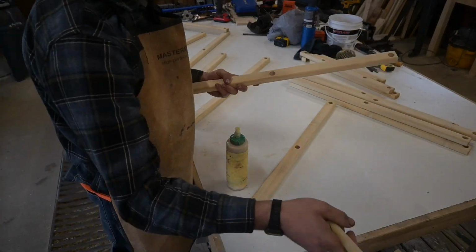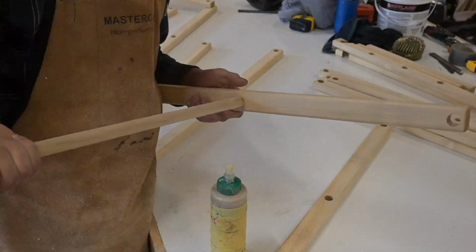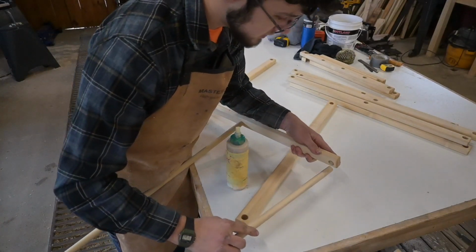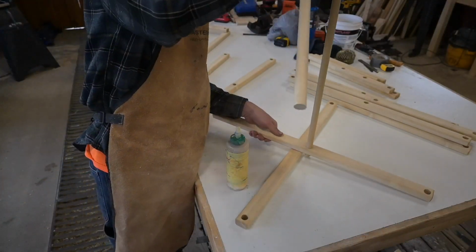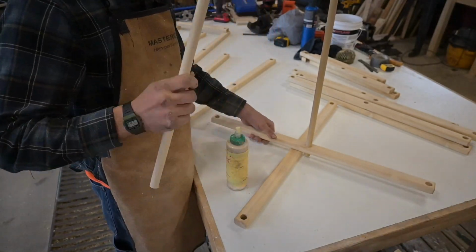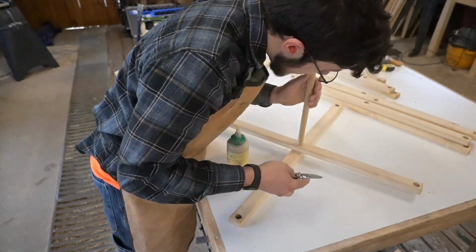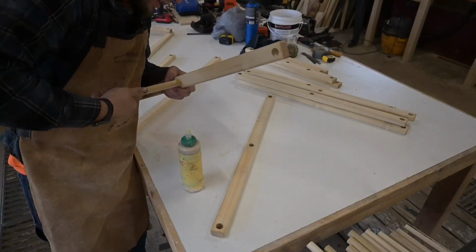So we're going to stick a dowel through it, because it's on the inside. It doesn't have glue. It can't have glue, actually. And this dowel needs to be actually the thickness of one of these boards narrower, because it doesn't have another board to go through. Actually, does it? If this is like this, make them the same, so it would be the inside, so it needs to be two thicknesses narrower. There, and there. Mark it with a knife. That is the thickness of this piece, because this piece is not going to have another connection on the bottom.